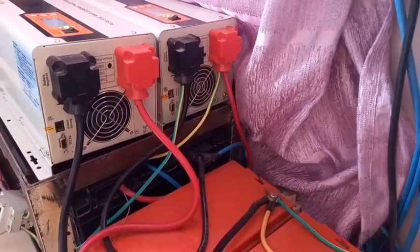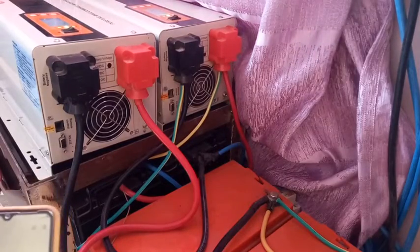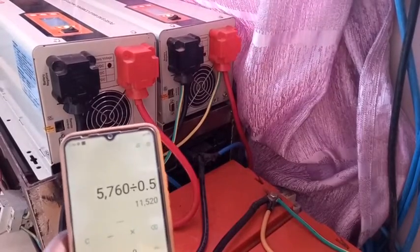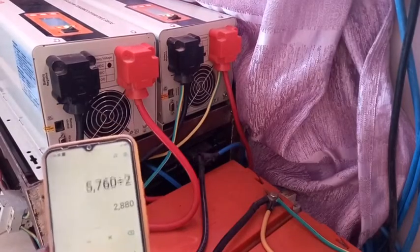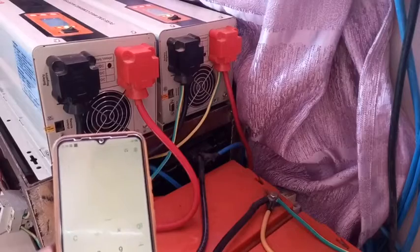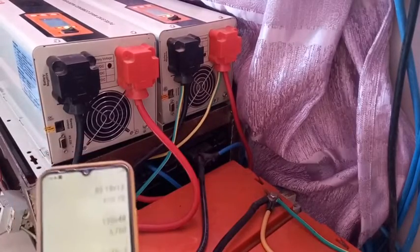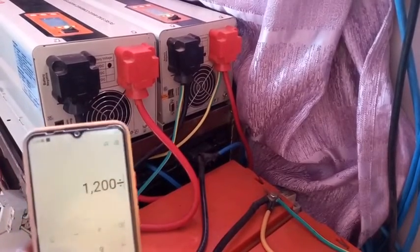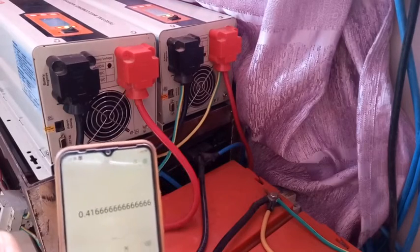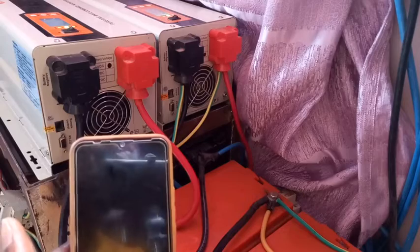The other inverter is consuming around 100 watts and runs on separate gel batteries — these are 120 amp-hour batteries. So 120 by 48 volts gives 5,760 watt-hours. Discharging to 50% gives 2,880 watt-hours of usable capacity. If this inverter is drawing 100 watts over 12 hours, that is 1,200 watt-hours. So 1,200 divided by 2,880 means the inverter alone would be using 41% of my usable battery capacity. This is seriously insane. During the day I can run this inverter, but at night it's nearly impossible because we'd be doing 50-50 with the inverter.